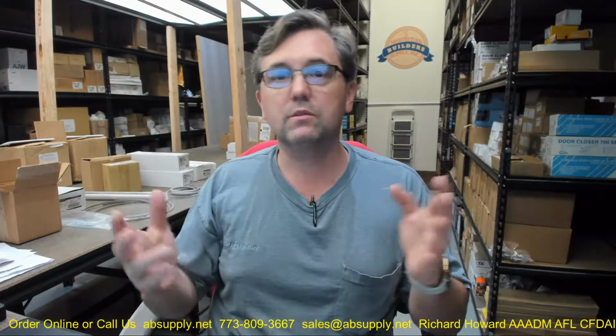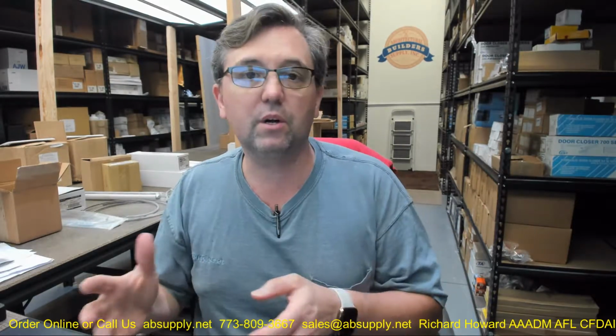not that you could necessarily use this on a fire-rated door because it's not listed, so let's back up. If it's a door that has to close and latch every time, like an exterior door for a security situation, maybe it's an entry to a daycare, those doors are going to need to latch every single time they're opened. You can tailor it, so that's a neat way to go about using the material beyond the way DraftSeal intended to use it.